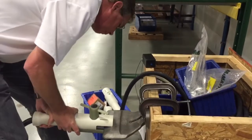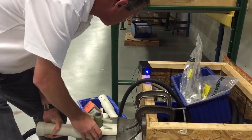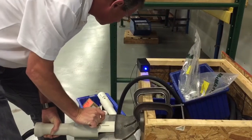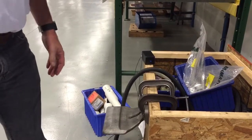Watch the blue light in the background. The blue light won't come on until we fully engage — just like that. Now that we're fully engaged, the blue light comes on. We can enable or disable electrical devices such as contactors or breakers, acting as an interlock.